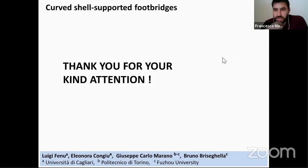Of course. The form-finding, not — because actually the deck was hinged to the shell. So the cantilever is hinged to the shell, and since we prestress the ring girder, we can counteract the torsion, exploiting the properties of the ring girder. And another thing — the seismic action, of course, is acting in both directions, both positive and negative. Did you account for both? Of course, yes. Okay, thank you.